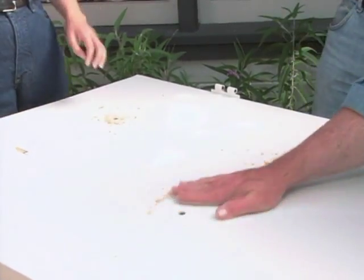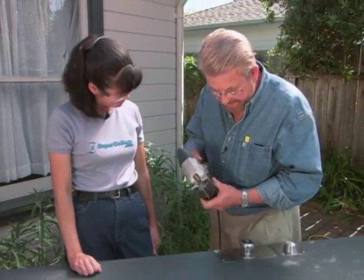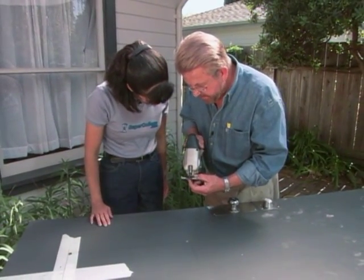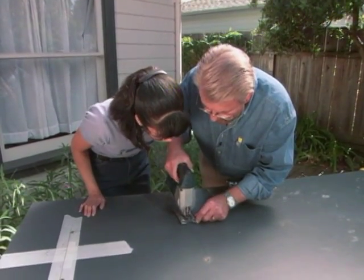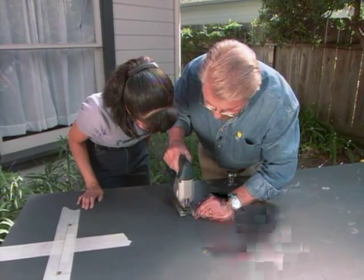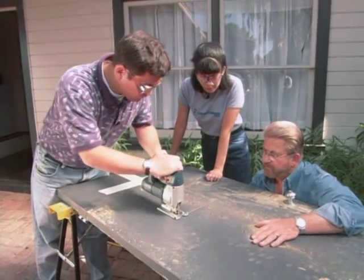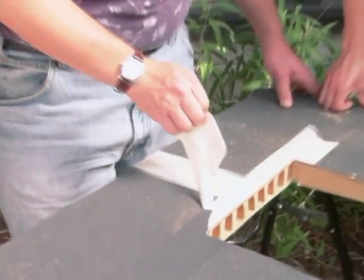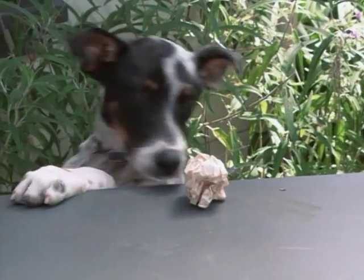Those are our four corners of the opening, so we're ready to cut. Have you used a jigsaw before? No, never before. One thing — there's a little notch right here. The idea is to keep the bottom of that notch on your line. Gen and Kelly quickly get the hang of the jigsaw, and before you know it we have a hole in the door. We no longer need the tape, so we pull it off.